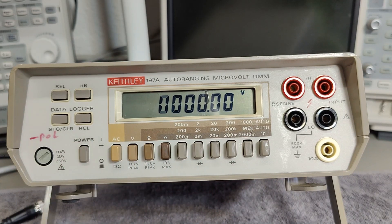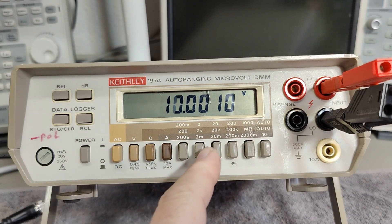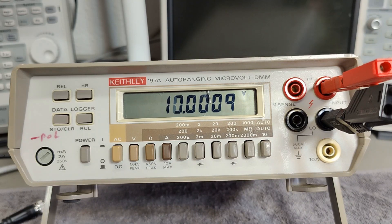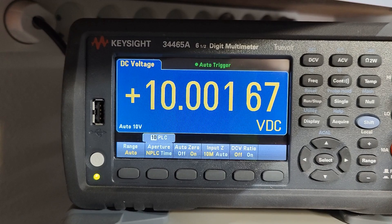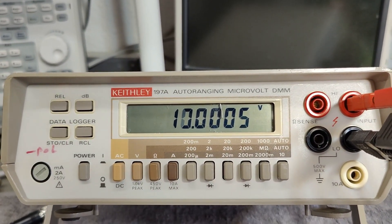Maybe I will check if it's accurate or not. So this is 10 volts, and this shows us the resolution in the 20 volt range: 0.1 millivolt of resolution. That is really nice and fine. I just give it about 10 volts and it is very, very close. I am only 1.7 millivolts too high at the moment. I just turned on some stuff here, so I think we definitely need to wait a lot longer before we can really say who is the most accurate.